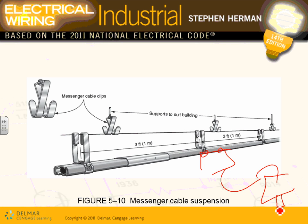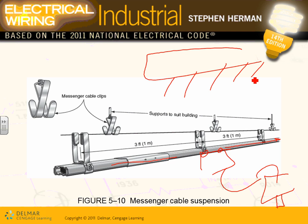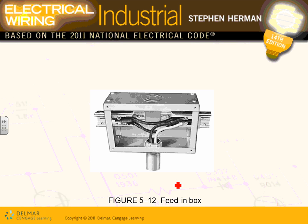Here's my tool, and you move it along the track. If you have a light, here's my lighting fixture shining in here, same thing. You have a track, you feed your lights, and then you can move them. Your lights are physically hanging from the trolley, so you can drag the light. They're physically and electrically connected to the trolley. Does that make sense, guys? And you drag that light along the perimeter.